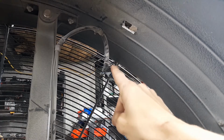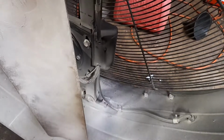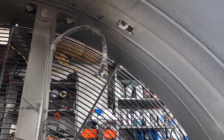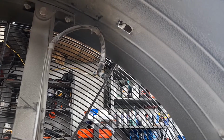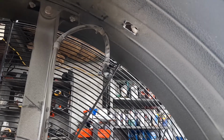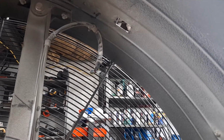This might be reduced down here in this box below, as far as to only send 4.5 alternating current volts to not blow out or melt the switch. So I'm not saying that 4.5 volts is or is in fact not correct, but I am just documenting that 4.5 volts at the three-way switch, high, low, and off, is here and present.